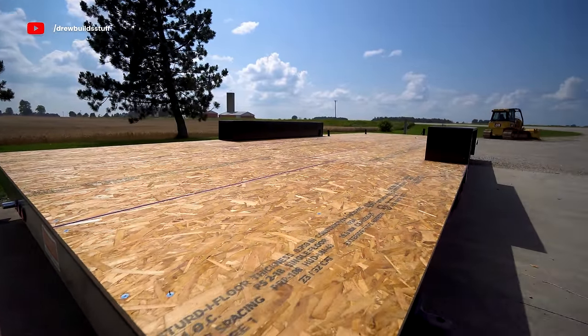Now I'm just making up a template for the second portion of the roof, and once it fits, just making up a bunch more rafters. When I got to the point that the two slopes merged, I decided to take these structural screws out because they have a pretty big popping out head on them, and replace them with nails. And then I can just butt this second board up right against it and give it a couple screws. And then I just gave this piece a hurricane strap.